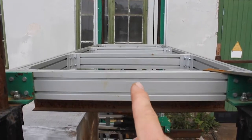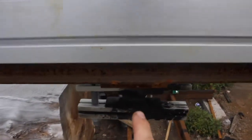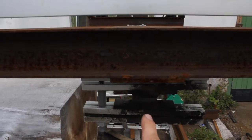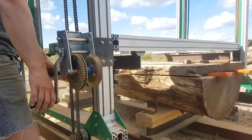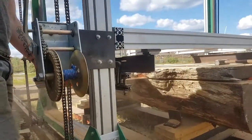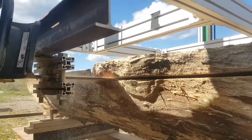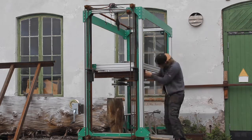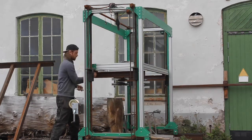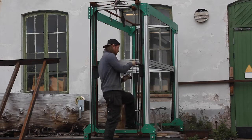This platform is going to be replaced with the beam - this is what I had been using previously. You can see bar clamps, and this is where I would clamp the chainsaw bar. The chainsaw engine would stick out over here and I could just run the throttle like this and push the whole cart. Since I'm not going to be using this anymore, I've decided to utilize some of the parts - I'm going to unassemble this and remove the bar clamps because I'm also going to be using those in this next build.